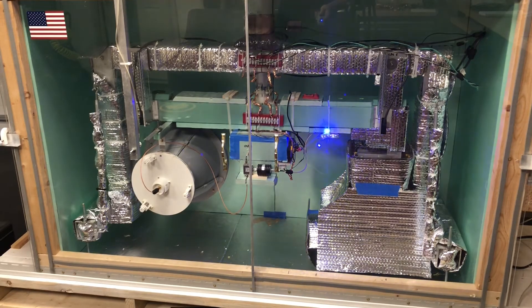The signal generator generates the signal, which goes into the back of this box and into the amplifier. The amplified signal then comes out into the circulator, straight through the circulator, up along this wire, and into the frustum, where it resonates at 2.407 gigahertz in a mode called TE013. Any reflected energy comes back through the cable, and because this is a circulator it takes a right-hand turn through the attenuators and up into the signal generator where I can detect reflected power. The signal generator is connected via USB through the liquid metal contacts and over into the ADC.